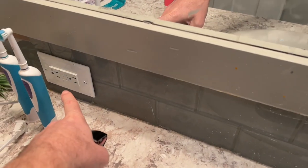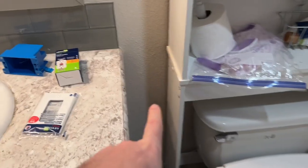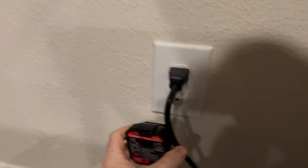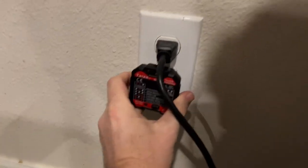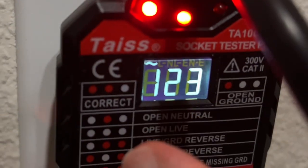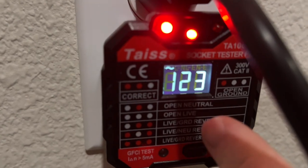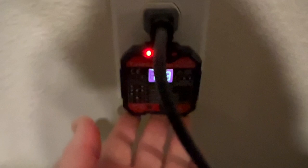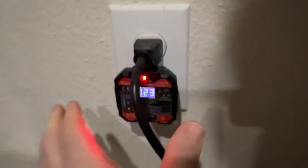I can't tie into this one — this is more work because we have an outlet on the other side of this wall right about there, just a few inches difference. So we're going to tie into this one. This one is active right now — you get the two red lights, which means it's correct, about 123 volts coming through. It also has GFCI outlets. This one is not a GFCI protected outlet.